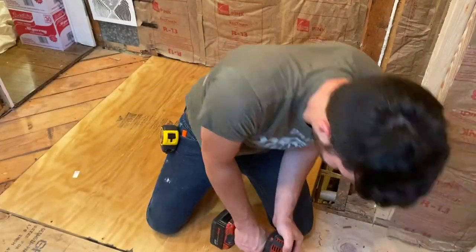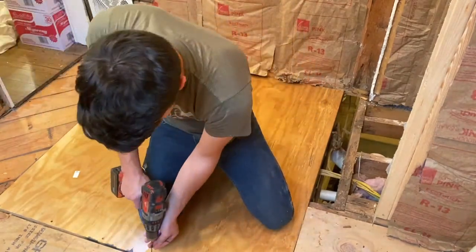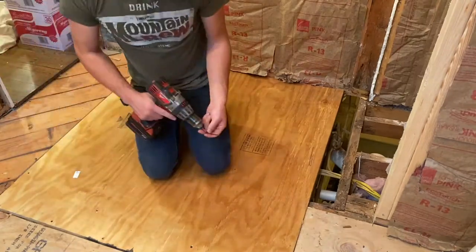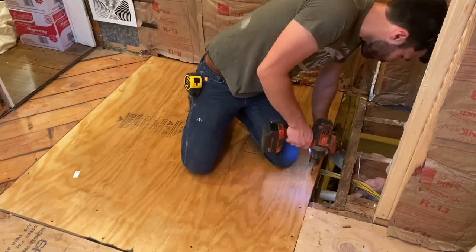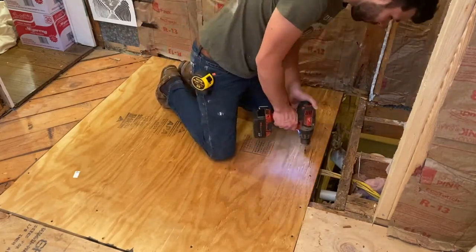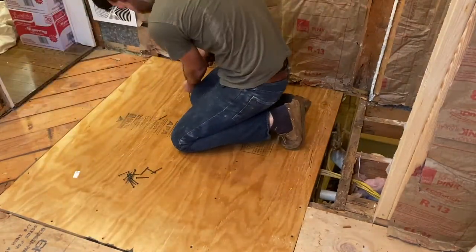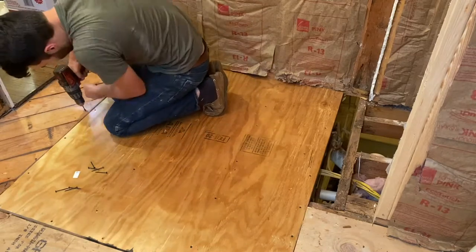There are a few ways you can fasten this down. One is with nails — you'll want to use construction adhesive, put that down on the floor joist quite a bit before you put the plywood down, so it holds it tight. The nails won't eventually come loose because of the glue. You can also use screws — these do not wiggle loose over time, they won't squeak, and they won't allow the plywood to move at all. I'm going to use screws to fasten this down, every eight to ten inches, and that will really hold this plywood in place with no movement at all.